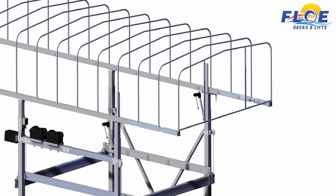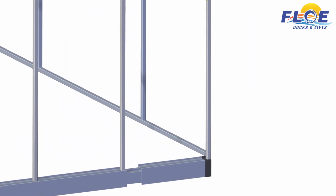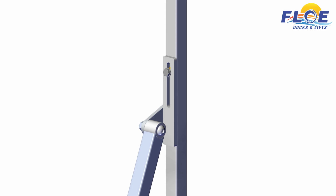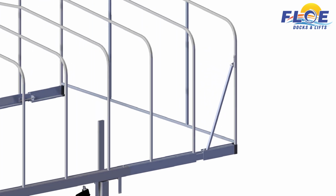The adjustable corner supports are installed in the same way, with the same fasteners, as the non-adjustable brackets you just installed on the other end of the canopy. Ensure these brackets are installed with the elbow facing out as shown, with everything in place. Tighten the top bolt to 10 foot-pounds, and the bottom bolt to 60 foot-pounds. Repeat on the other side.